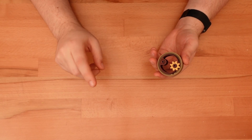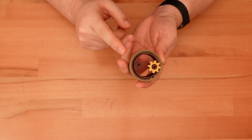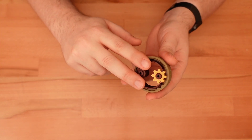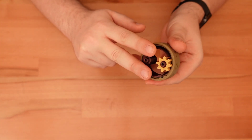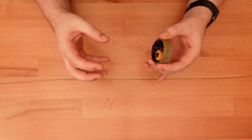So if you plan on printing this, I strongly recommend printing only a single layer — one number ring, one core, and one index wheel — to make sure the parts slide smoothly together. If they do, print one more layer and make sure those mesh together.